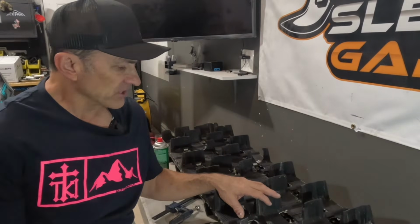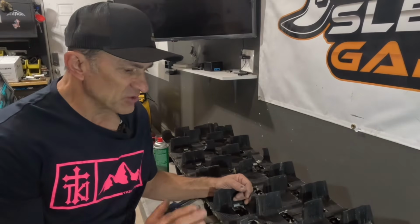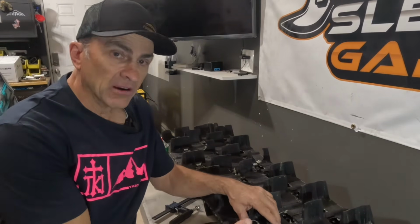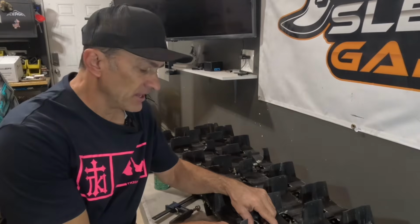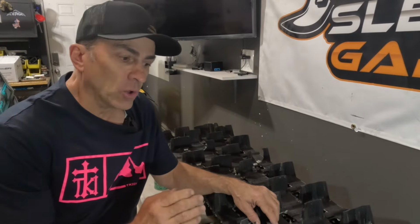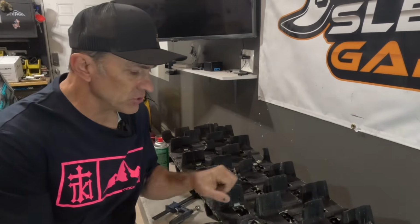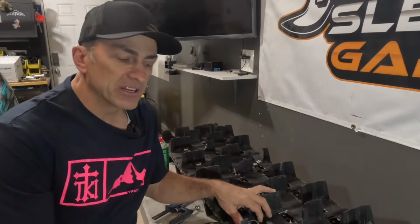So, all right, now that we've fixed our one lug, we have a few other lugs on this track that we can fix. Other than fixing split lugs and cutting off lugs that are half hanging off, another thing that's fairly common is you can get a lug that tears off from the track itself and tears off the rubber and leaves the nylon cord underneath exposed. And if the nylon cord is cut in any way or is severely damaged, your track pretty much can't be trusted to hold up, because it's those nylon cords that give the strength of the track longitudinally. And if those are broken and torn or ripped, the integrity of your track is just not going to be something that you can trust.